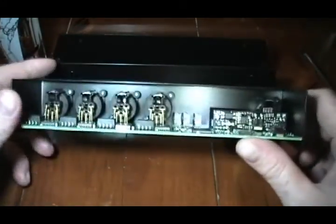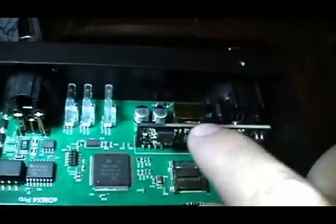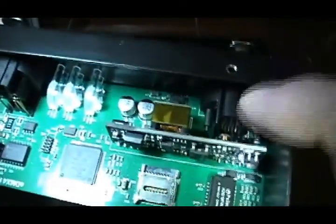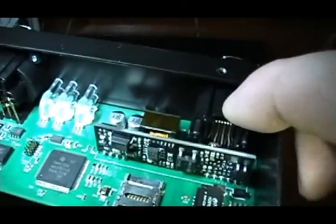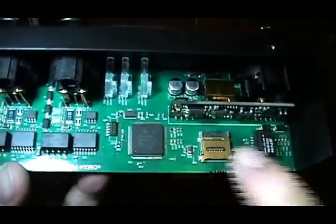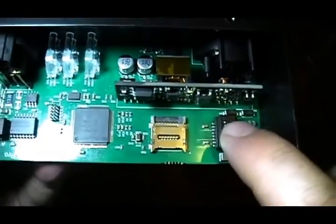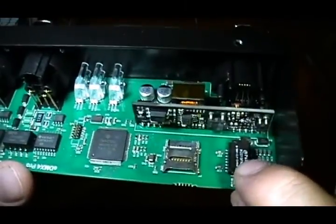I just wanted to have a look in the hood and see what's in here. Well, being Power over Ethernet, this module here is going to be off the shelf — not made by DMXKing, I don't think. These are probably a very standard module that you'd insert into a product like this. It'll not only deal with the Power over Ethernet sense stuff, but also drop the voltage down from 48 volts to 5 volts for the circuitry on the board. Over here, this is going to be our Ethernet pulse transformer, with a transmit and receive transformer in there that connects to the EtherCon connector. It forms the physical side of the Ethernet interface.